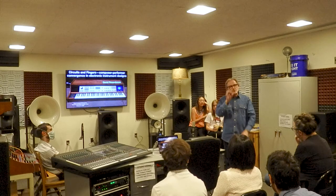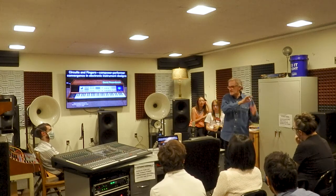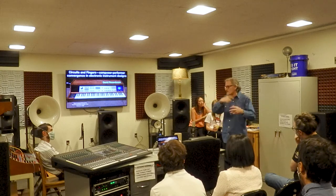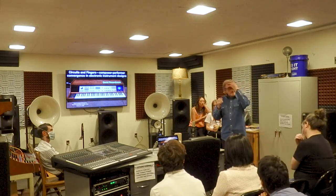So they could be attached to virtually every sound generating parameter in the instrument. And it was under computer control so that you could put logic decisions at every breakpoint. So you could say, okay, proceed if key one is depressed, otherwise loop back to here. Or if some sensor you plug into the instrument is doing something, jump ahead. You can make all these logic decisions in the envelope structure.